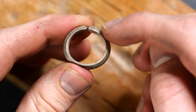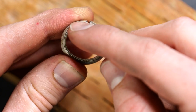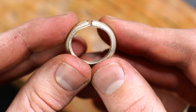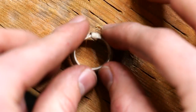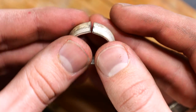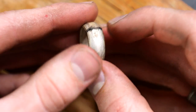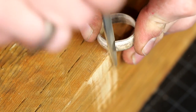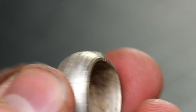Things are looking really good. You'll notice at this point there's a little bit of a warped oval shape to the ring — that's totally fine. All you should be worried about at this stage is just making sure that you've got a nice roundedness to the whole ring; you don't want any flat sections. Now I'm ready to focus on the joint. You'll notice it's not looking very good — I want them to meet together flat like this, right now it's looking more like a gap. So I need to spread these back apart just a little bit and go in with a hand file and file them to shape. This is going to make the ring a little bit smaller than I wanted, but that's okay. Now I've got the ring just how I want it — that gap is a lot nicer, those ends are matching up really great now.